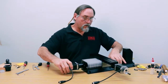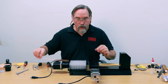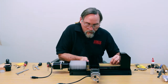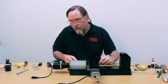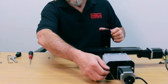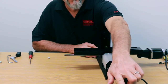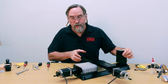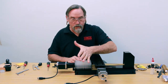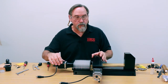The reason you can't have your other cover on here is because you need somewhere for this rod to go. If we had the rods going through the other way, it would work for both covers, but then you'd have rods coming out in both directions, and as your table moves, these rods extend further out past the stepper motor and back. So we decided this is the best design. This is the critical cover — it covers this part of your ball screw, and the brass tube covers the other side of your ball screw. So there you have it.